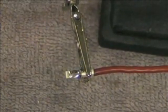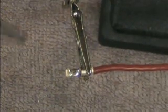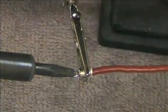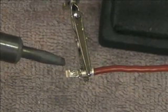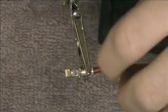Yeah, it's all gone back there. I actually had the heat on a little long, but it's pretty much what you want to do. I got a little bit too much on here, had some shaky hands. So this is kind of how you use this braid - just heat it back up and just go over, rub over where you need to take some off. It's a pretty cool little deal - it'll just pull off any of that extra. See, it just sticks to that braid and you just cut that off. Basically that's that and it sucks it in there. It's pretty cool - once you get everything up to heat the solder will actually flow into the contact and hook up with the wires.